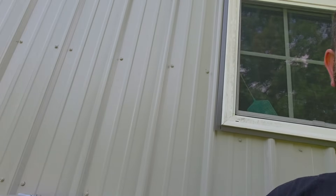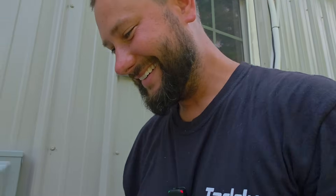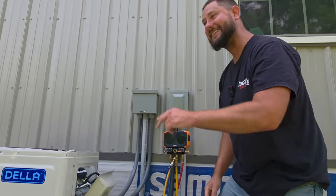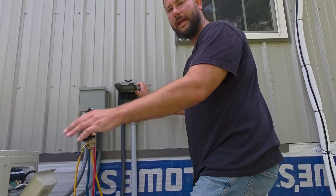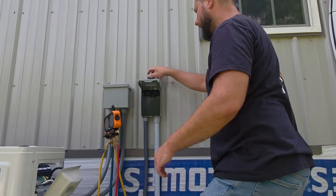So my son being an electrician — your son hooked it up? Yeah. I could kick him right now — he's supposed to be an electrician! Let's get this fixed, we'll recheck it. Make sure you disconnect the power before you touch anything electrical on a mini-split. It's got an inverter board and a bank of capacitors that hold charge. Disconnect power for 15 minutes, then make all your changes.